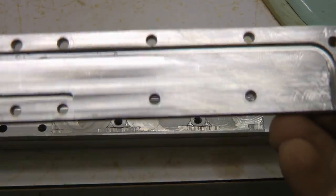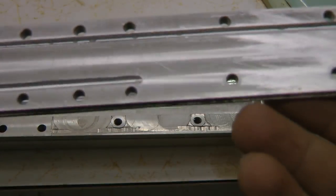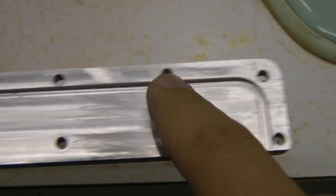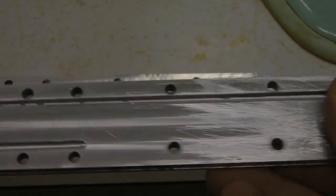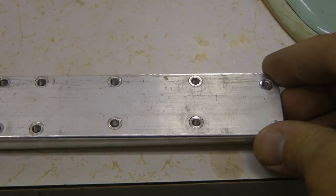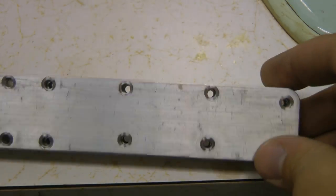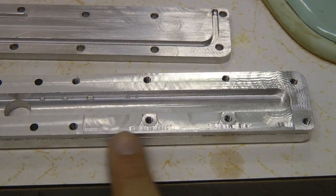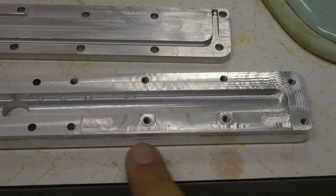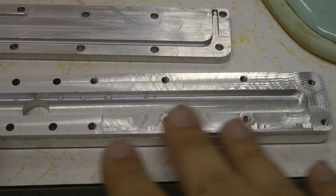The other side is just another simple bar that's been faced off. There's some room here for gaskets that I found weren't needed, because the facing operation is precise enough that when they're screwed together, only a tiny amount of air leaks out between the gap. I debated trying to drill a whole bunch of small holes to replace this slit, but the slit arrangement seems to be the best — it provides a very uniform air jet across the entire width.